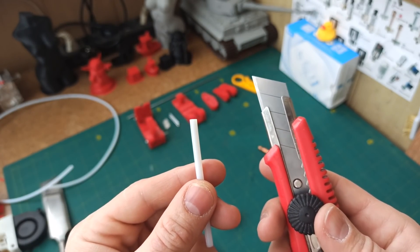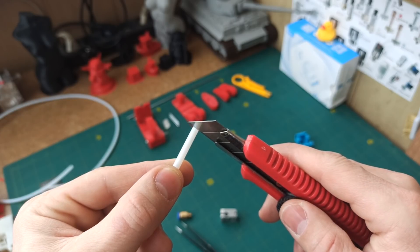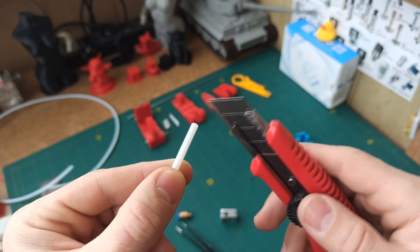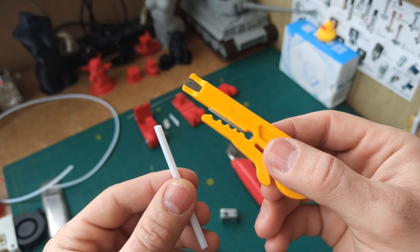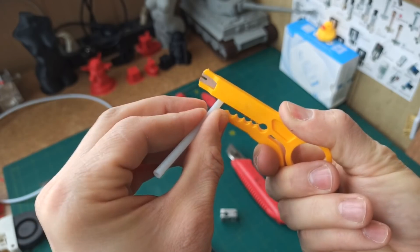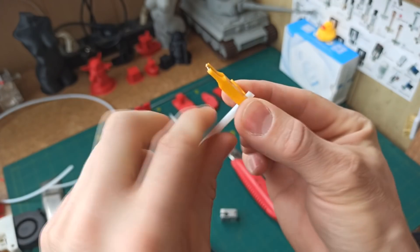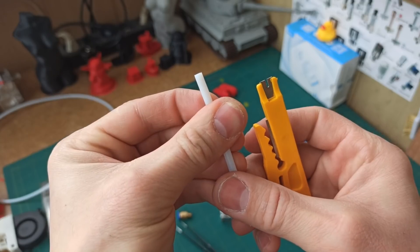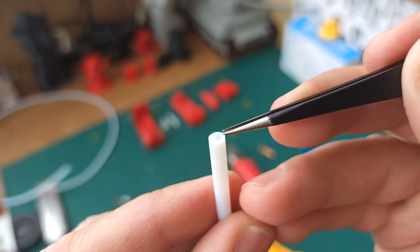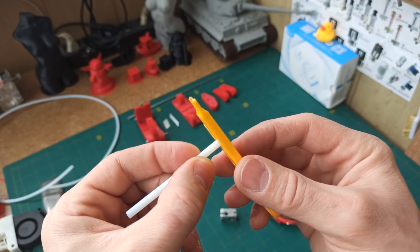For this purpose you can use a stationery knife, but I want to say right away it's a thankless task, because perfectly aligning the knife so it cuts maximally precisely is very difficult — there will always be some deviation. You can, of course, buy this kind of tool from China. Let me show how it works: insert the teflon tube, press slightly and rotate. It seems like we've cut at 90 degrees, and at first glance it looks very straight. But if you look closer, you can see a burr has appeared, and the surface is not perfectly flat, because this type of blade cannot cut precisely around the circumference.